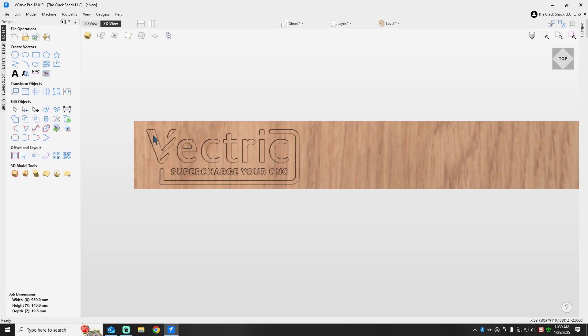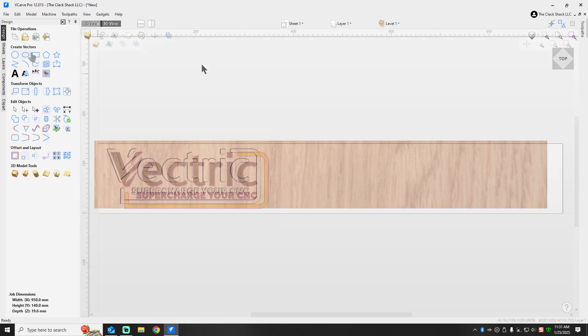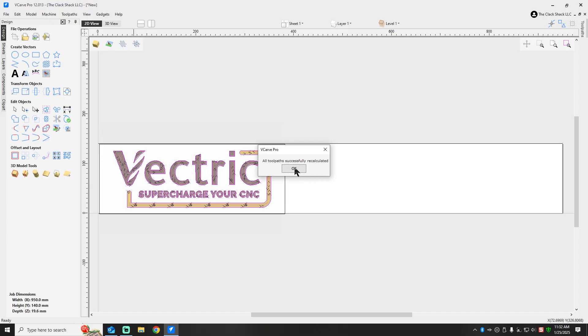I do not want to drag out any of the little eighth-inch bits and sit here and wait on it to chisel it away. So the diameter of the bit dictates the smallest corner you can go into. Now on the outside, if we were making this raised outwardly and taking the rest of this down, we could do that if we wanted to try to retain that. So I'm going to go ahead and put a square rectangle shape in here so that we can center everything. Recalculated the tool paths, just so everything lines back up, and we're good to go.